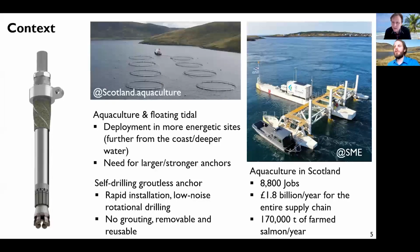So we ended up with a simplified method to design this, because usually for rock, if the cyclic stress is below 70% of the rock strength, you can apply millions of cycles before it fails. So we just said, let's keep it below a certain threshold, and this should be okay. But we have not tested it nor modeled it yet. Yeah, I think that's a very sensible approach. And if you wanted to do really cyclic loading, you would need a more complete constitutive model rather than just a strength criterion, which is a lot more complex, obviously.